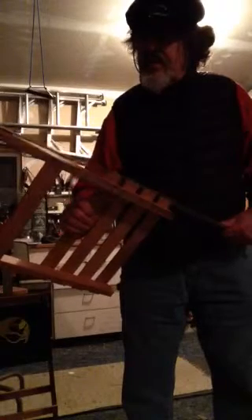The part you sit on has two uprights. These are 19 and a half inches long, by inch and a half wide, by three quarters thick. You have four cross pieces that make the back. They are a quarter inch thick, by inch and three quarter, and they are 14 inches long.